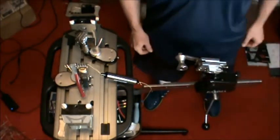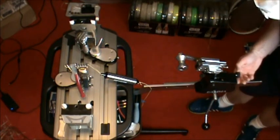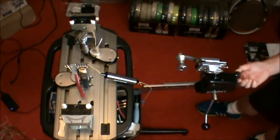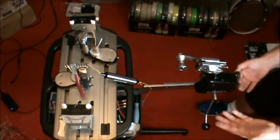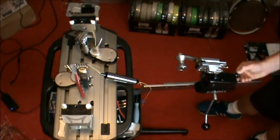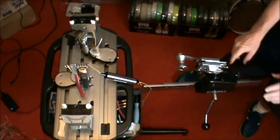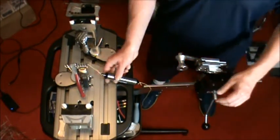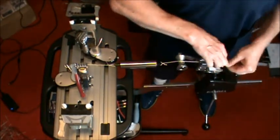So now we're going to try other tensions. So come over here and change it. Let's say we're going to go up to 50 pounds. So we had it at 40. That's 45. We could check 45, but I'm going to go ahead and go up to 50. So that's spot on 50 pounds over here on our indicator. Let's see if the calibrator is revealing 50 pounds on the actual pull.